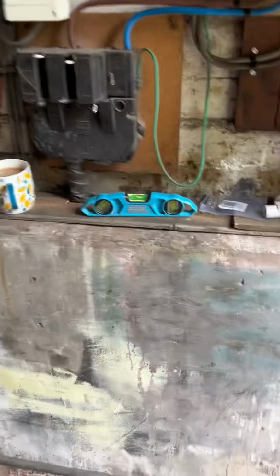So gas, I'm probably going to do a bit of conduit or something here. I've already marked it out and used a level. I haven't got a T on me, so I got one of these from Screwfix. I thought I had a round, circular conduit box one, but I don't. So conduit, T-box, one to the water and one down to the gas. I'll probably float out the bottom, go through the frame and to the meter box.